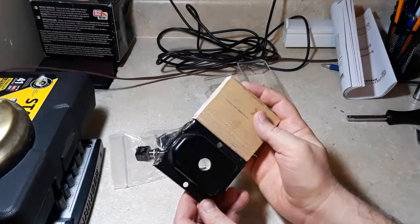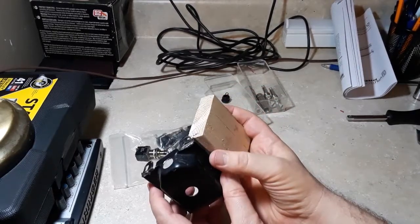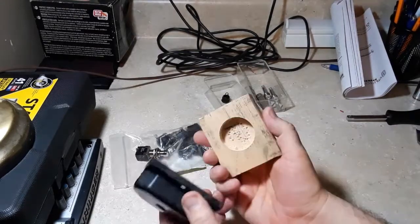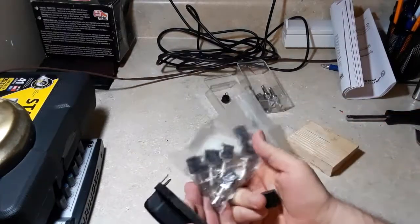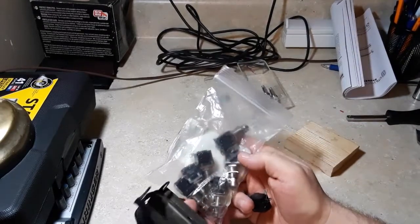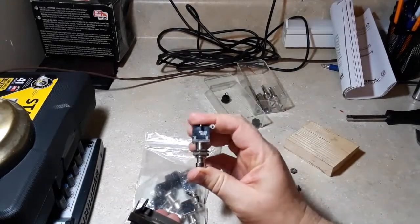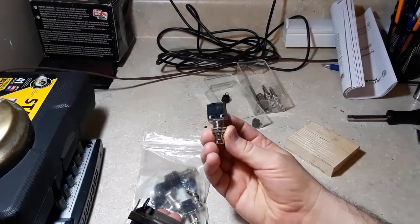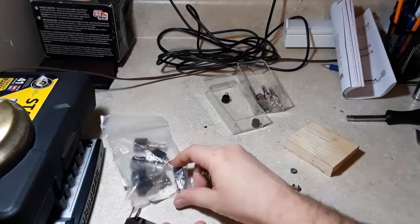This is something that's not going to take me a long time, and hopefully it's going to help somebody out when they have a footswitch that works with the amplifier they're going to buy. Some other things I found: I got this bag from a pedal project I was working on — it was actually a looper, a digital looper. I ordered the wrong switches. These are on-off switches, and what I wanted for that digital control was momentary. So now I have a bunch of these that are perfect for building foot switches.